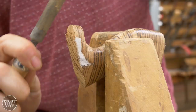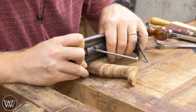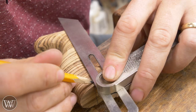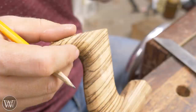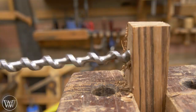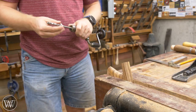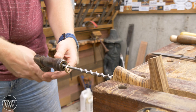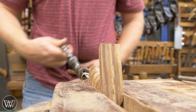It's a really personal thing — give it a try sometime. Now that we have it shaped, we need to do some of the more detail work on it. Because I made it larger than it needs to be and taller, we need to cut the top and bottom off to get it to the right size. I first want to figure out exactly where I want the screw to go through the handle, so we're going to lay that out top and bottom. If ever you're drilling a hole for something, test it first — make sure it's the right size. I need to create a slightly larger hole for the head of the bolt to go into, and then a smaller hole for the shaft to go all the way through.